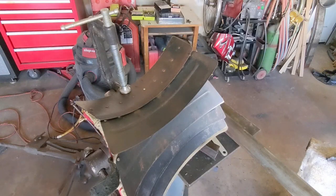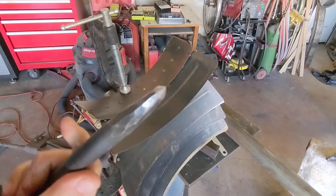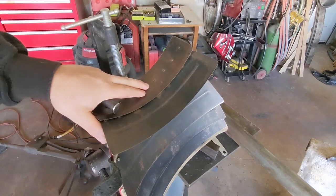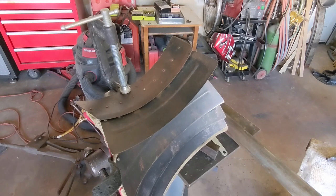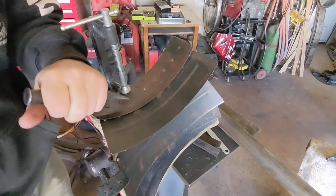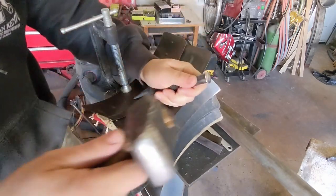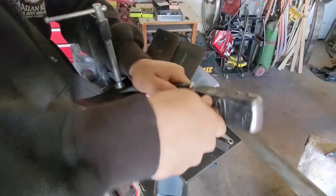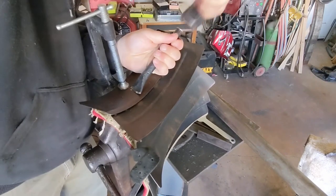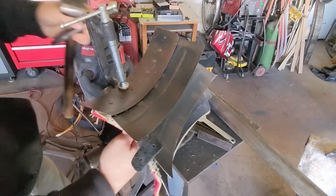Let me get my hammer. Okay, I'm back. Chisel. Hammer. Center punch — this is a tool I didn't talk about earlier, but I use a little center punch. You can also use a nail set or any small punch that is the diameter or smaller of the shaft of your rivet that you want to punch out. It's pretty much as simple as chucking your piece up in the vise using a C-clamp or some other method depending on the shape, making sure your chisel is nice and sharp, getting in there right on the head of the rivet and giving it a couple little taps. You'll shear the head of that little rivet right off. Get it nice and flush, and a lot of the time the rivet will just come right out — I'm not even going to have to drive this one out. The rivet has come off.